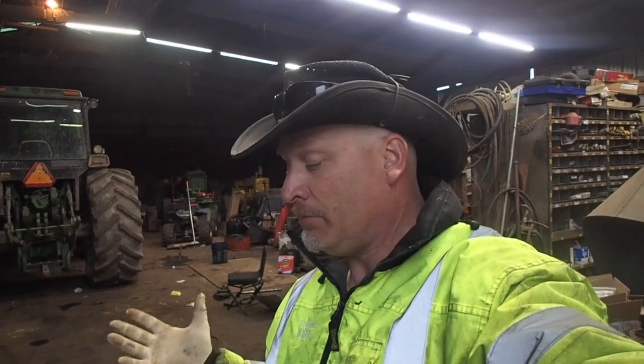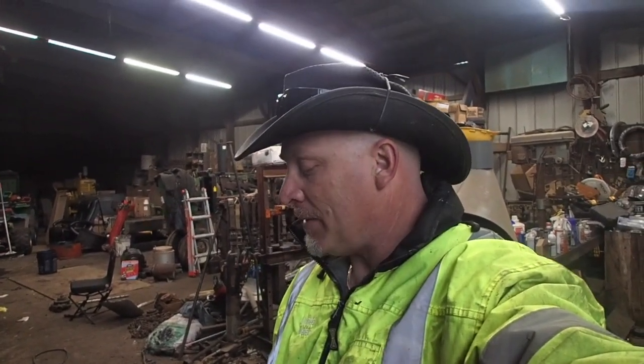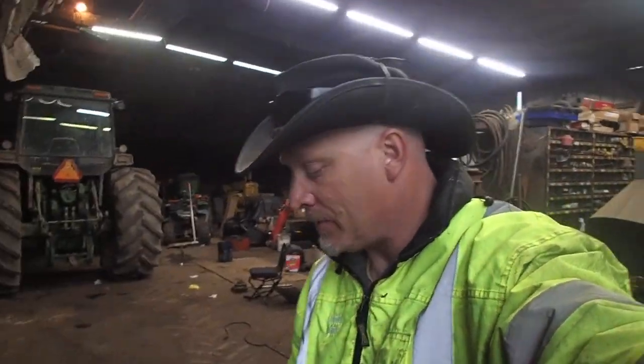The pressure rises inside the tire so incredibly fast that it will blow up even if the valve core is out. You can go to YouTube and look at welding tire explosions. I know Chucky2009 did a video the other day. I didn't get to watch it because, quite honestly, I already know the information. But he did it for people that don't know the information and could possibly get themselves into some serious trouble. I probably should watch this video before I post this, but I'm not going to because I just don't have time. But anyways, what I'm going to start by doing is actually torching out the center of that thing,